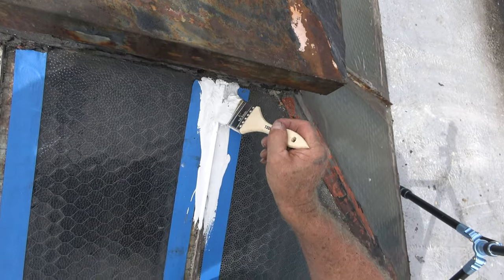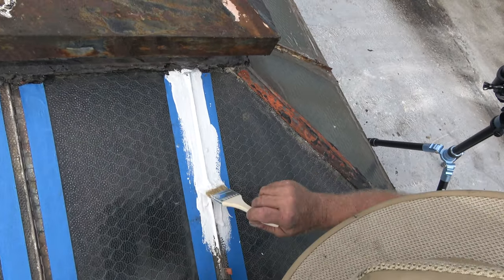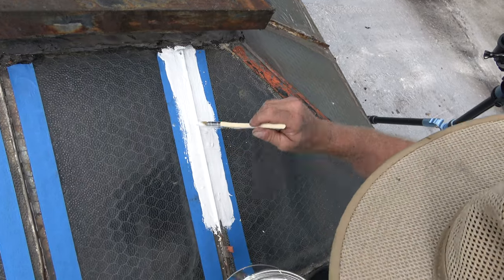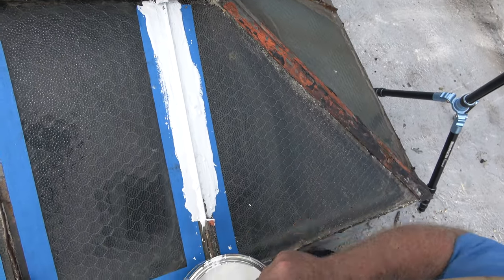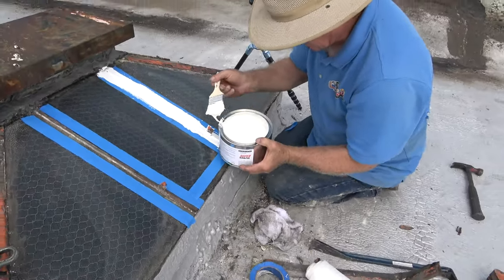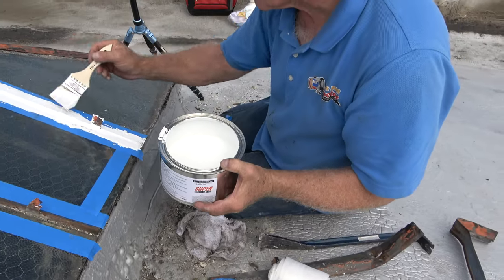I don't remove any goop there — see there. That's how you do it. There's some putty left in there; I don't scrape everything out. I'm just trying to fill this up. It's filling up nice now. And that's how you can restore your skylight without having to spend a lot of money — by cleaning out and taking those metal strips off that protect the putty.